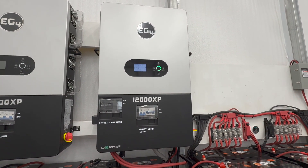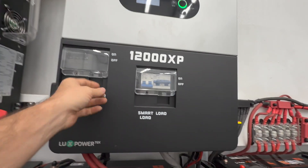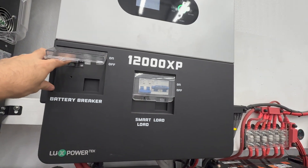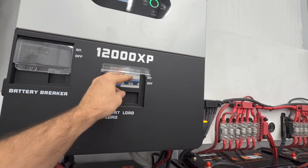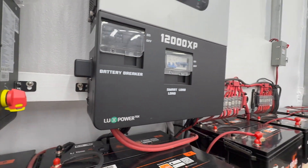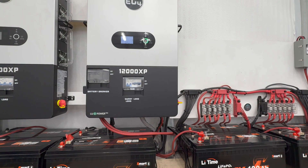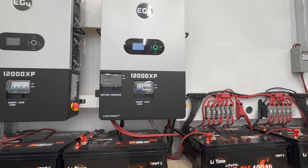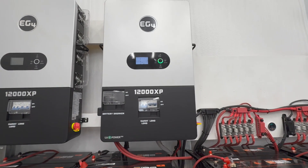What do I like about it? I like that it's a single unit — all in one — and it has a lot of different breakers built into it. It has the 300-amp battery breaker, the smart load for turning the load on and off, and the EPS switch on the side. It does save you money on installation because you don't need to purchase as many components as with a separate system. It is a high-frequency inverter, which most of them are these days.